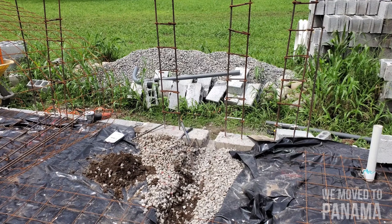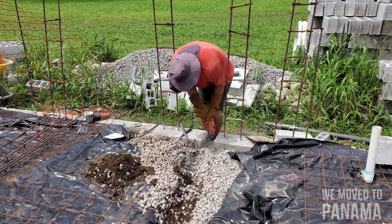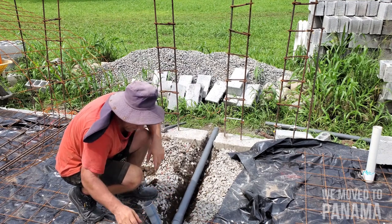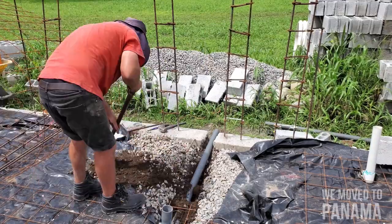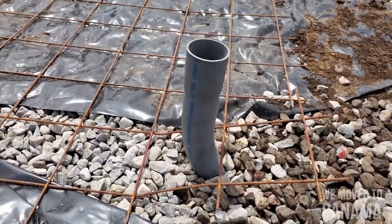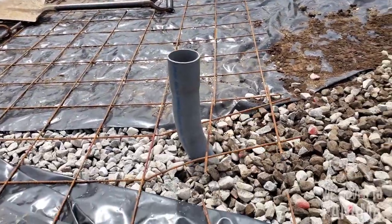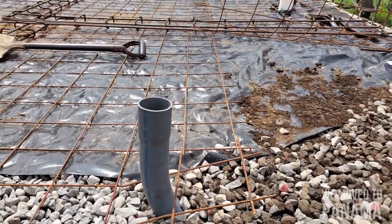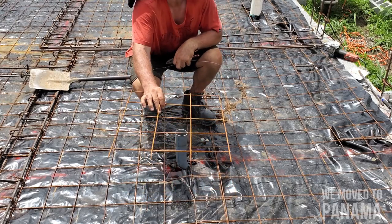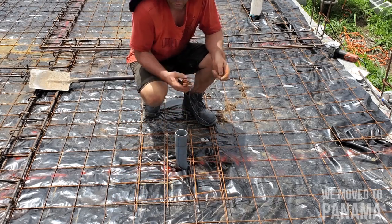I just need to drill a little bit more in there — it didn't take too long. I'm done. I already cut the pipe — that's all you need. A little bit closer look — so that's how my pipe comes out. I've got another piece there. I'm going to leave it on top. The inspector said a metre up, so I'm not going to cut it short until I'm 100% sure where it must go, and then I'll cut it. I put all the plastic back and the grit again. I cut another little piece — because I cut this here — I'm going to put this over it and tie it down so it stays together as a unit.